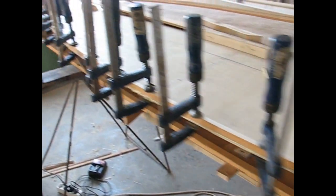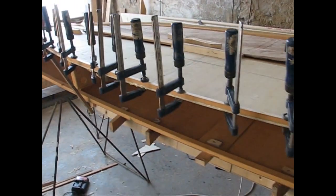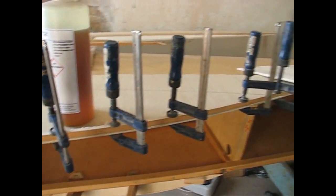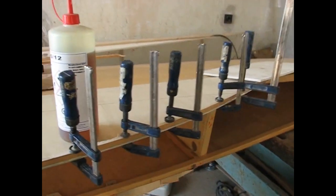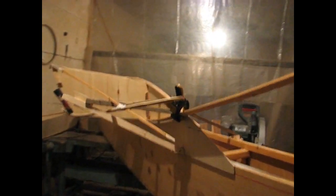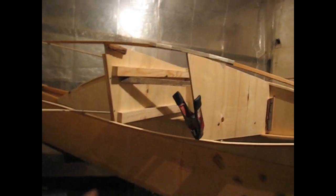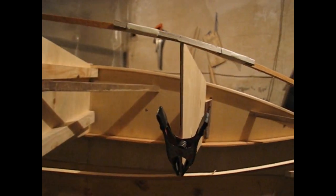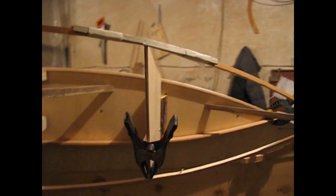In such circumstances, when you just want to straighten out the ply so you can keep working properly, the batten will probably be left in there. Just use polyurethane glue which dries in 10 minutes and you can keep going. These are the final bulkheads. Another one like this needs to be made for the other side, and it has to be put in on exactly the same angle that we found with bevel squares.